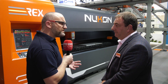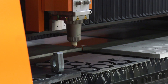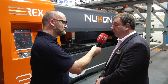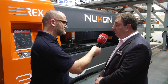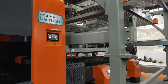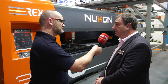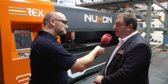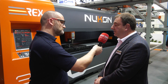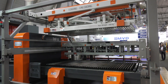You've got multiple machines in the UK now — what's the feedback in terms of reliability and breakdown? We've got a service division trading for about 20 years since 2001, repairing press brakes, shears, punching and CO2 lasers. When I first introduced the Nucon laser in 2016, we installed two at the start of 2016 and haven't been back except for warranty service. We explained to the customer how to lubricate, clean the machine, change the water in the chiller — all simple weekly, monthly and yearly maintenance operations.